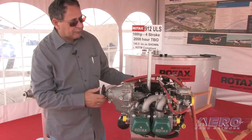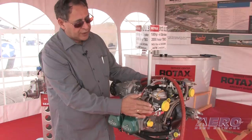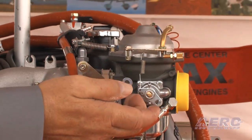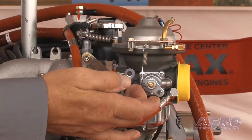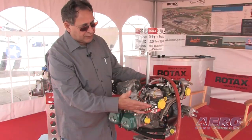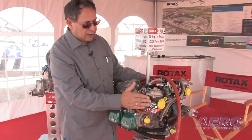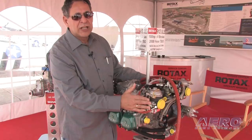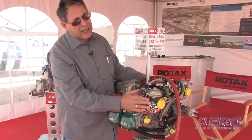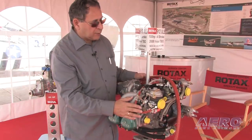Also called out for maintenance are the carburetors. Carburetors do have wearing components — we have a needle and a slide internally, and they're subject to vibration and also contamination from carbon buildup if you're running the engine rich. So every 200 hours the carburetors would be disassembled by a trained maintenance provider, checked, cleaned, and reinstalled. At that 200-hour interval we would also have to balance the carburetor synchronization.